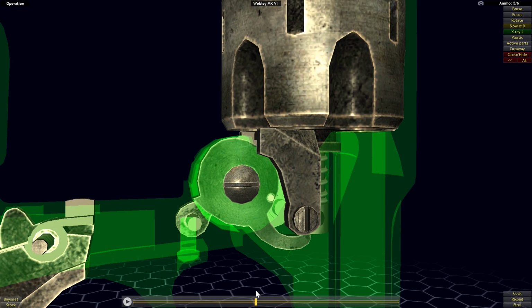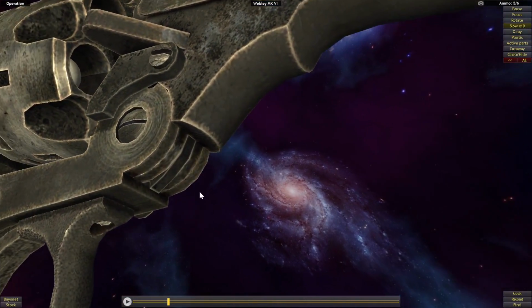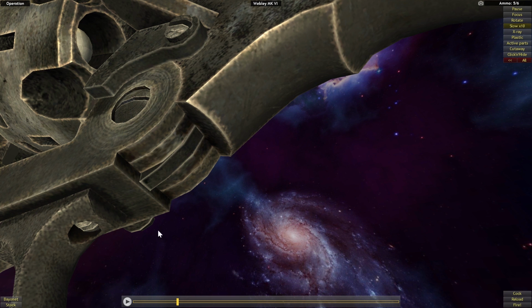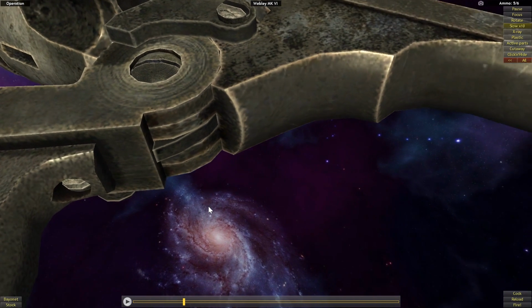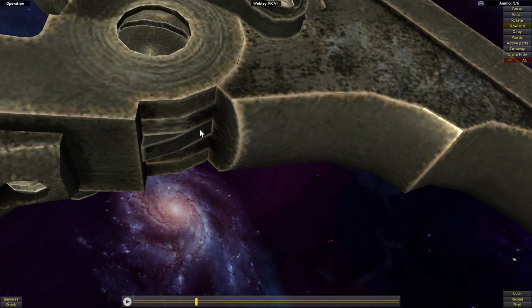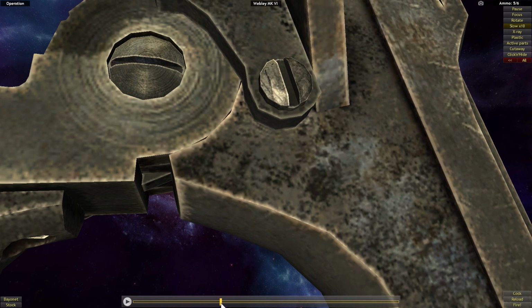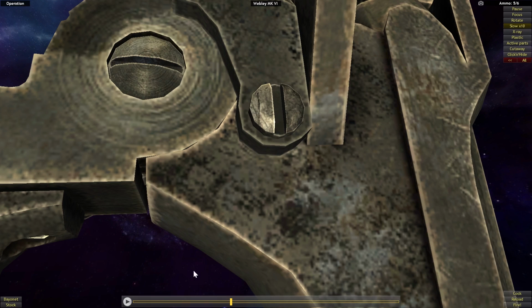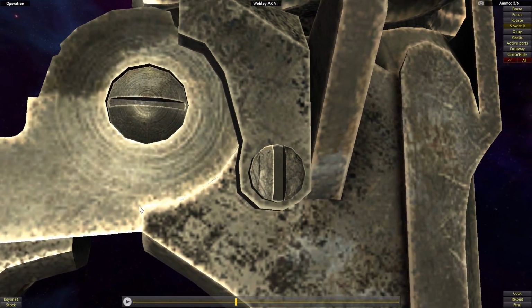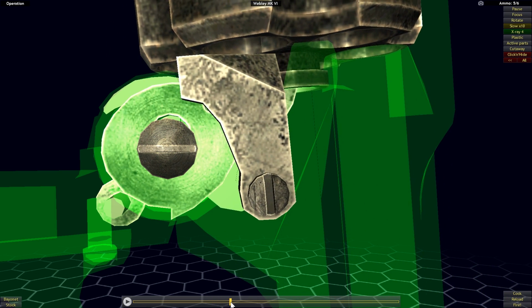Now, what causes this to occur is a camming action with the top part of the frame. And I'm going to have to come out of the X-ray so that you can see this. So you can see the disc here. And right now, this tooth comes up against the lower part of the frame and stops the disc from moving. But eventually, the top part of the frame, as it comes around, is going to cam along this tooth that sticks out from the lower part of the frame. And eventually, that top part of the frame is going to start to push up on that tooth. And once the tooth is pushed up far enough, it'll break its contact with the lower part of the frame, allowing it to spin.